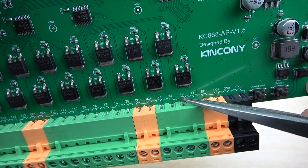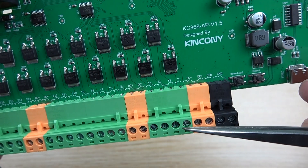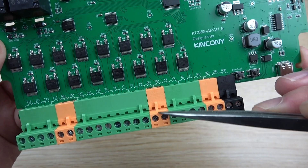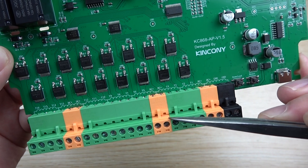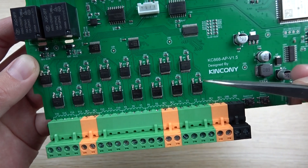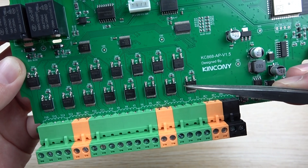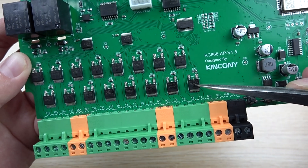You can see output 1, output 2, output 3, output 4. If you connect with an LED strip R, G, B, W it will be easy. This is for power — you can use 12 volt or 24 volt and connect the LED strip directly. Each driver chip supports 3 ampere, so you can drive a 3 ampere LED strip directly per channel.